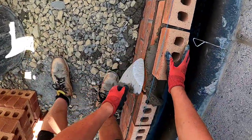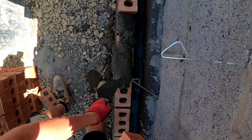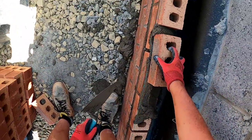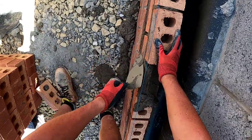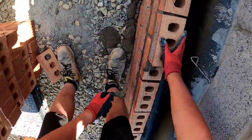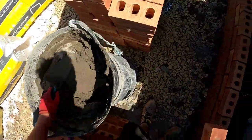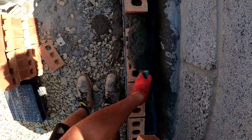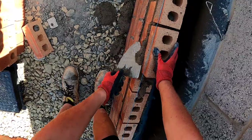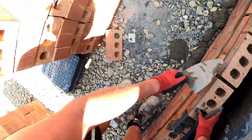Same thing with the boards and the tubs — I get people constantly asking me about them: why do you work out of tubs, why do you use such a small trowel? Because you can lay more bricks with a smaller trowel — if your arm isn't as tired, if you can move your arm quicker, especially in summer. If you are putting one spread down to one brick, that mortar is nice and fresh and workable. People argue with me until the cows come home, but because they don't want to try it or learn anything new. I was laying bricks for the best part of 10 years before I learnt how to do pick and dip.